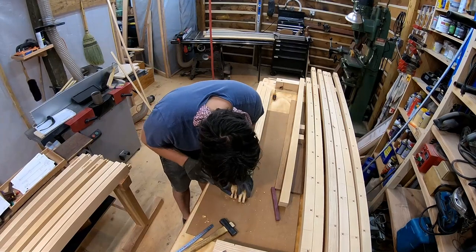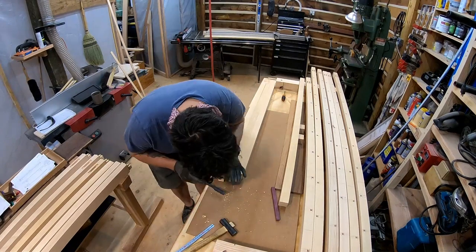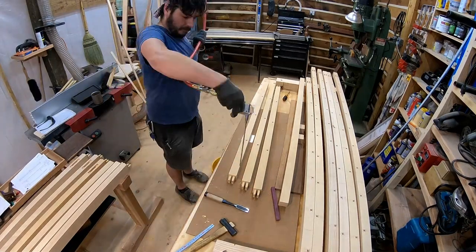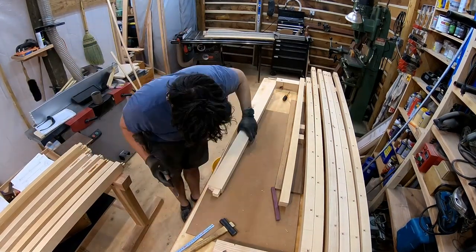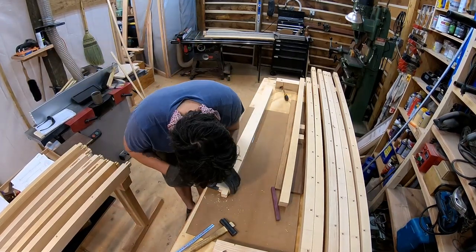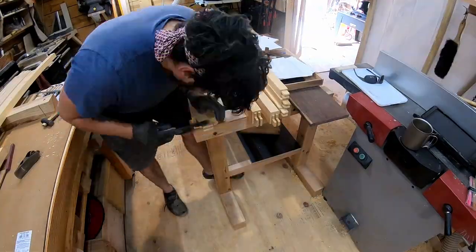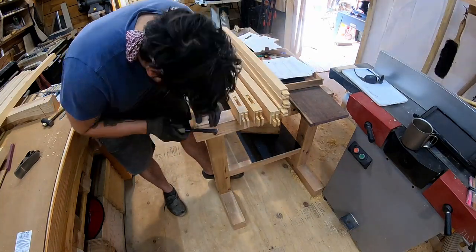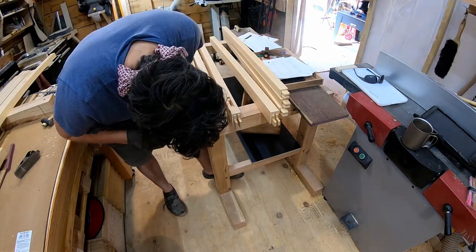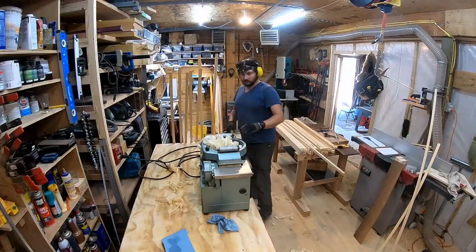Once I've cut all the joinery, mortises and tenons, and everything is ready, I have a final step, in a way to sort of indicate the piece is done: chamfering all the tenons so that they easily feed into the mortises. When you have a large glue up, there's only three big pieces here, plus the kumiko. You really don't want a piece to not go into the hole. So a nice chamfer in the directions of feed is really important, especially on the long sides of the tenons, because often there might be a millimeter oversize, because those are really going to get compressed. You really want a nice tight joint there, and so you don't want that to crush the fibers.